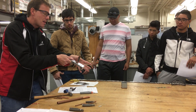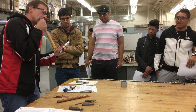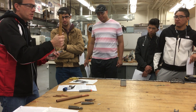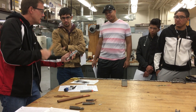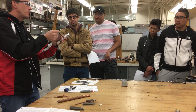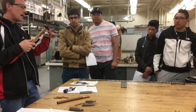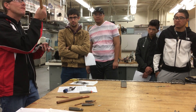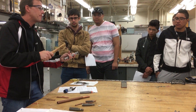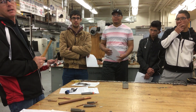I'm going to hold this up against my thumb. Notice how I don't hold the hammer up near the head — that doesn't have any momentum or leverage or weight. When I hold the handle where it's supposed to be held, down at the bottom, that's going to give me the weight I need with the ball-peen hammer to impact the swage punch and push it in. It's just like a flare — it's going to stretch out the pipe. That's what a swage is: we're enlarging one piece of pipe so that another piece of pipe the same size can fit within it. That's the swage definition — that's one of your words of the day.